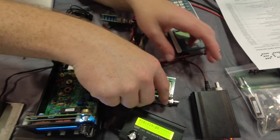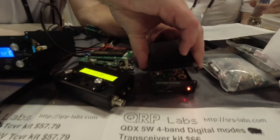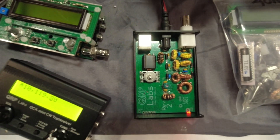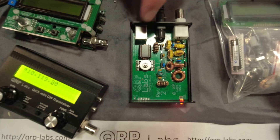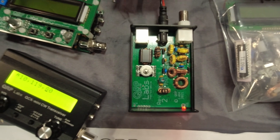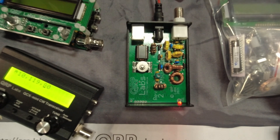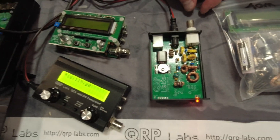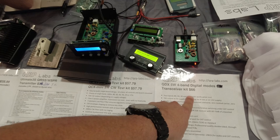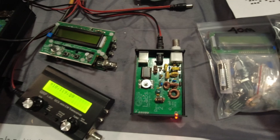This is our latest masterpiece, which is a digi-modes five-watt transceiver for four bands. It does things like FT8, JS8Call — five watts! It includes a high-performance 24-bit USB sound card and a serial port for CAT control, all over the same USB cable. It works with FT8 software like WSJT-X, JS8Call, Fldigi — all these software packages. And these are all kits — this one is $66! That's every ham's dream right there.